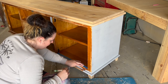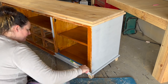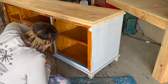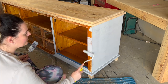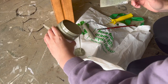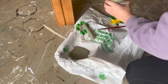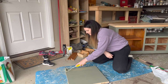Once I'd finished applying the masking tape, I went with my paintbrush and painted right up to that masking tape, leaving just a tiny little edge where I'm going to put my actual paint colour so that the primer doesn't seep through underneath. I also went along with my finger after I painted the side ledge and wiped off any excess that got onto the section I wanted to leave as original timber. I'm using a beautiful green called Myrtle from Puico — it's kind of like a real country green, and it's got a really warm feeling to it.